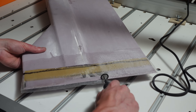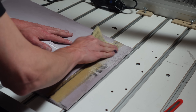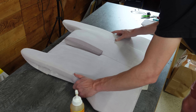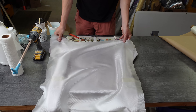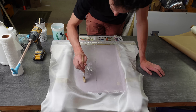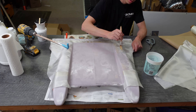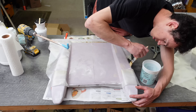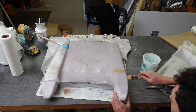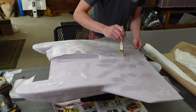The vacuum bag is just to ensure the composite fabrics are tightly adhered to the foam without any air bubbles in between. After the epoxy cured, I trimmed off the excess and did a little sanding. Then it was time to join the two wing halves together with Gorilla Glue, and after that dried, I draped a layer of 2-ounce glass over the entire thing. That took a while to wet out, especially with all the tight curves, but this 2-ounce glass is quite thin so it conforms to the surfaces pretty easily — you just have to make a few little relief cuts on the tight corners.